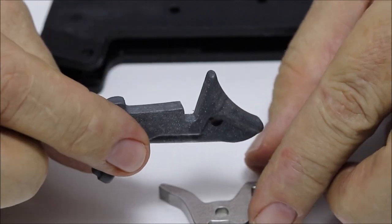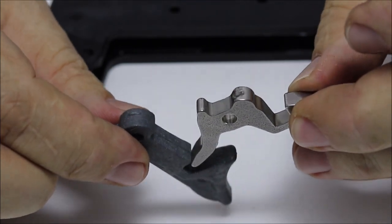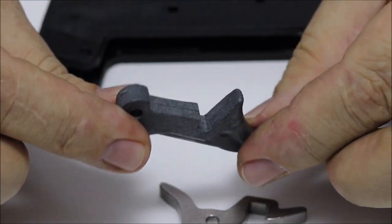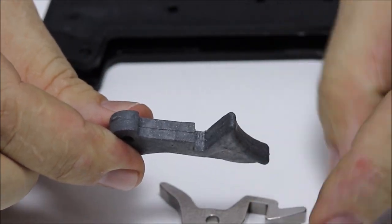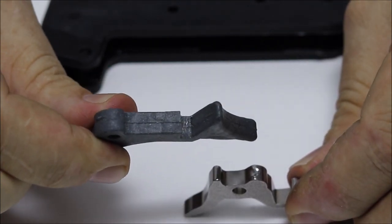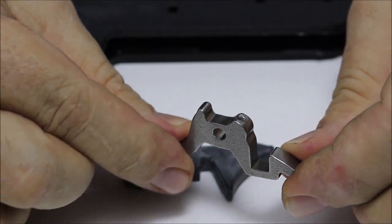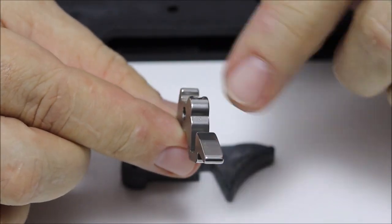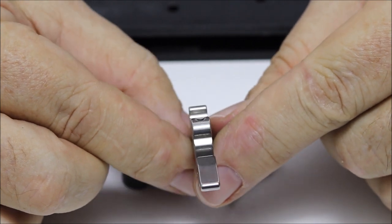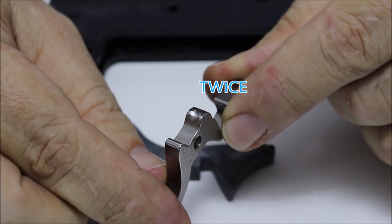It did not override the trigger because of the gear ratio — the trigger takes very little load and the material is very good in terms of friction coefficient. We don't use stainless because of that. This is the stainless sear; you can see the notch in the top that was damaged at 380 kgs of tension.